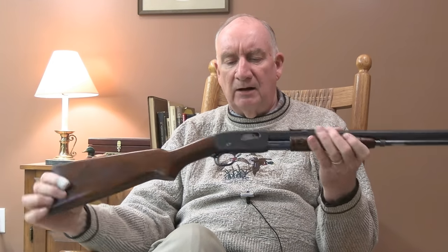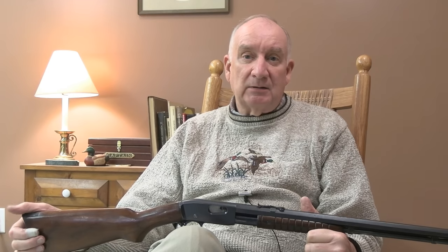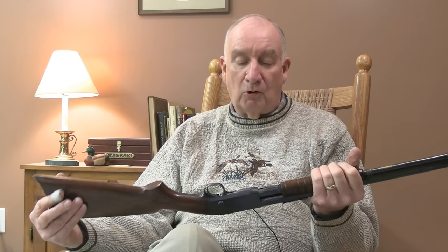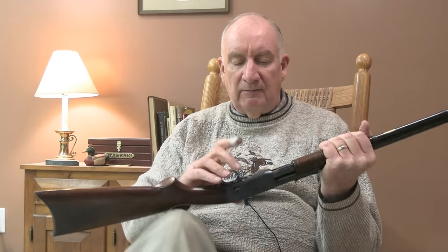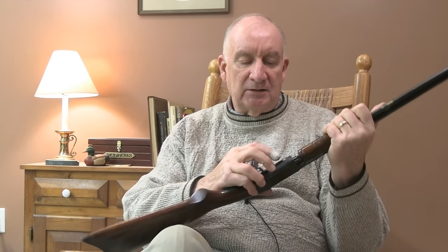In that era, the Model 61 Winchester had not yet come out when this was. The Model 61 Winchester came out in 1932 — you saw that in my Christmas video. I consider that to be a more elegant gun in terms of simplicity. It has a simple action bar; the bolt slides back and forth gracefully. It's a very simple gun — the feeding mechanism is extremely simple and it's a stalwart mechanism that won't go away because it's simple to produce. This one here has got an extremely complex design. Even the bolt release is a complex mechanism underneath here — there's a tremendous amount of machine work in this.